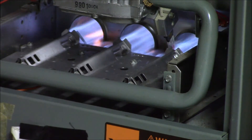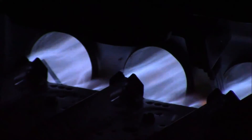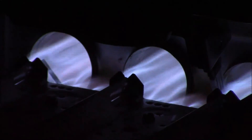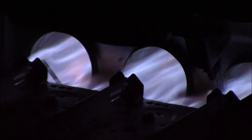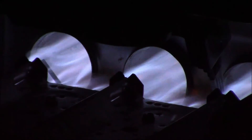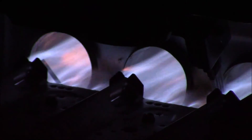The blower is on now. You're probably looking at that going 'I see yellow flames' — no. Let's turn some lights off. What you're seeing is orange flames, which are totally different from yellow flames. Orange flames, since we stirred up dust and cleaned the furnace, are just dust being burnt off. If these were yellow flames you would actually see a solid yellow color with a lazy flame. That's just dust burning off.